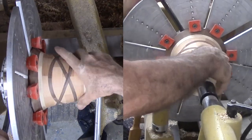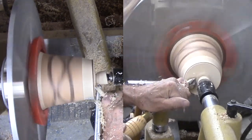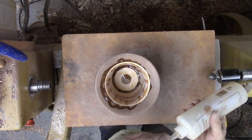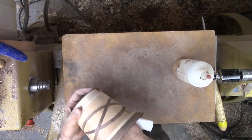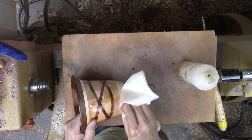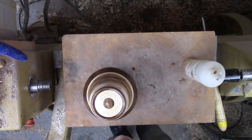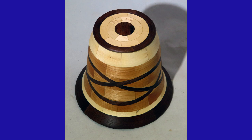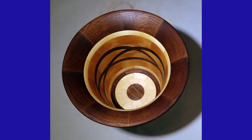Now to finish off the foot. That walnut is not a thin applied ring — it is actually a full depth ring but inset with a 5-degree taper for more strength. After sanding, a good bath in walnut oil provides a good matte finish. I have not decided whether to buff it yet. This completes my segmented vase with a 3-lobe Celtic knot using a bandsaw technique that enables a larger diameter regular knot with as many lobes as I want. I don't think anyone has done a Celtic knot vase this way before — I really like it. It is available as a remote demonstration. Please give this video a thumbs up, subscribe on my website and tell your friends. I appreciate your comments and questions. Every week I make a new woodturning video. Please wear your full face shield for safety anytime the lathe is running. I will see you next week with another woodturning video.